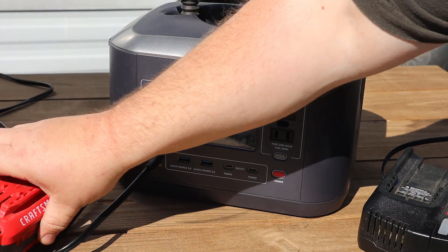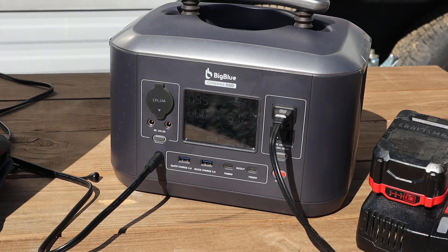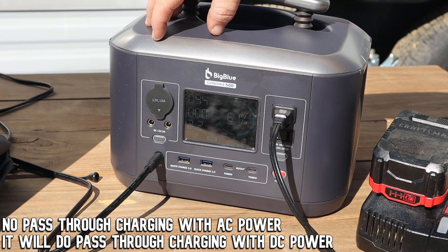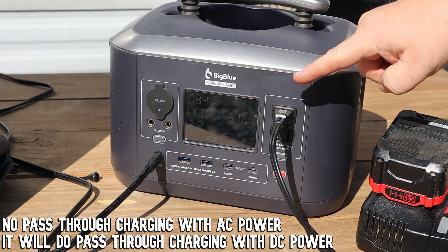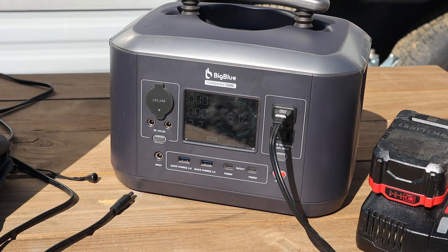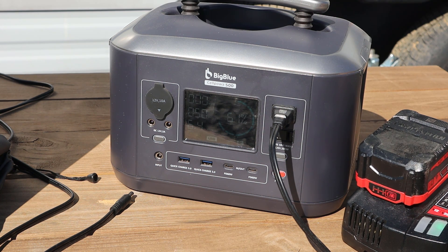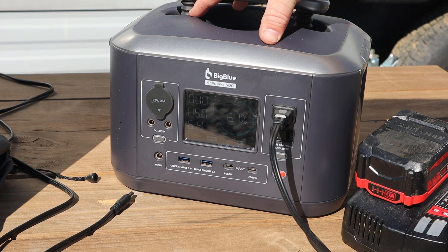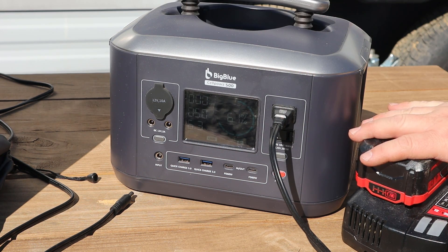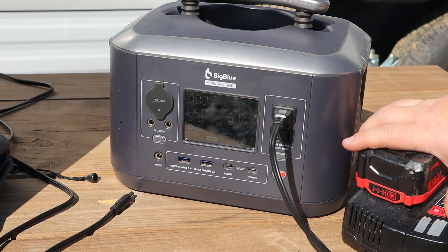At this point, we can get our battery charger out, pop the battery in there, and plug it up. We'll turn on our inverter. Here's the problem though — this little guy will not do pass-through charging. It will not charge the batteries from the solar panel and discharge the batteries to a device at the same time. I need my batteries charged, so I'm going to go ahead and unplug the solar panels. Now I can press this once and have the AC inverter on, running my battery charger. It's showing 61% battery from the Big Blue, currently using about 50 watts, and it will run this setup for six and a half hours. This is not going to drain this battery, which is cool.